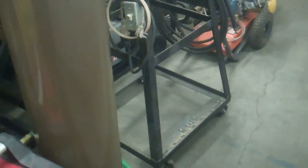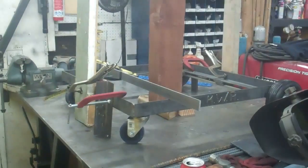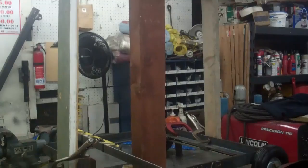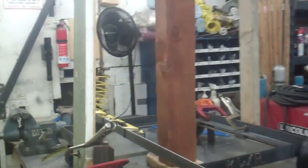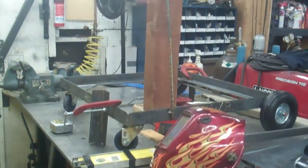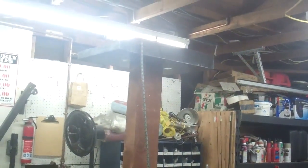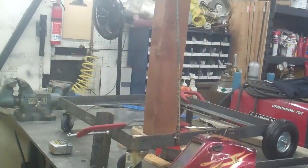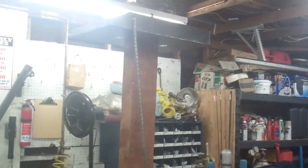On a bandsaw stand I only want two feet on the base because it's real light. The hard part when you're doing this — when the top's smaller than the base — is getting everything lined up right. What I did is took a 4x6 and screwed two 2x4s on it to get it at the right height. Then I welded two pieces of rebar on there temporarily just to hold it kind of where I wanted, and now I'll make the other pieces to weld in there.